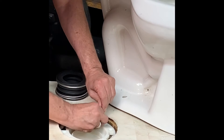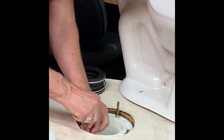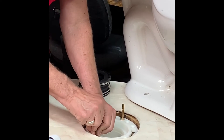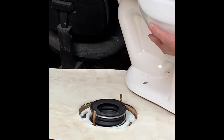You never have to saw the toilet bolts on finish, so you don't have to worry about sawing off that 5/16 bolt. Just line them up, screw your bolts down, and then pop what we call the forever seal back in place. It's going to elevate to any floor height now or in the future.